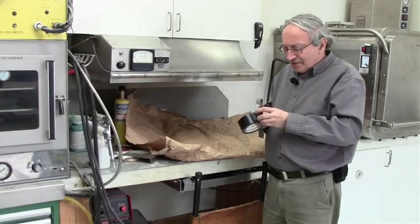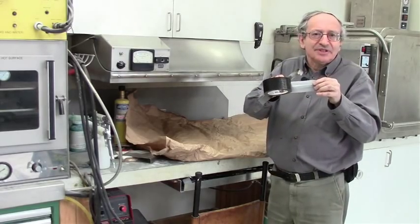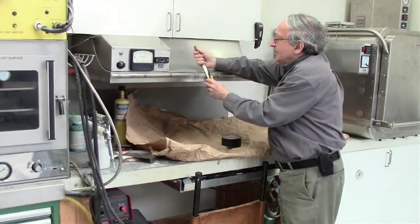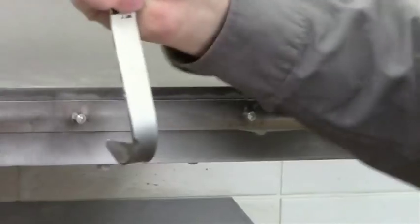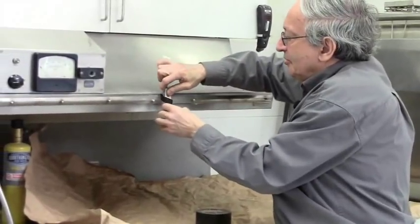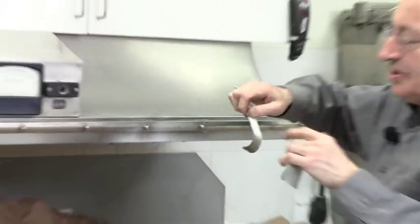The standard test for paint adhesion is a tape peel-off test. And the way it's done, you have to find a very strong tape, like the strongest duct tape you can find. You take the painted sample and you do a crisscross with a knife. Maybe 4x4 squares. You put the tape on and peel it off, and if there is any piece of paint lifted, it failed.